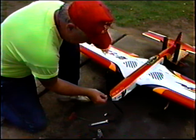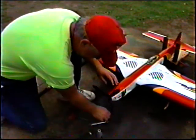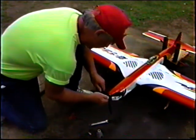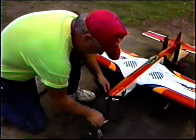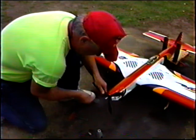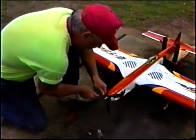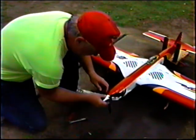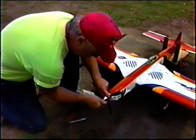Now this is the undercambered BYNO, the one I have thin blades. And again, what's real interesting here is Bill Lee's prop and the one George Aldrich sells are very, very similar. It looks like they were made on the same blank, really. Except George's is highly undercambered and Bill Lee's has very, very little, if any, undercamber. So again, if I can find the adapter, I just can't find the adapter. I can run those back to back and get a feel for if I'm getting any benefit from the undercamber.